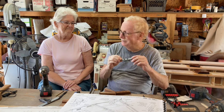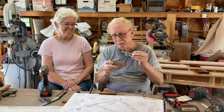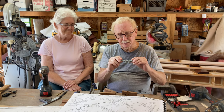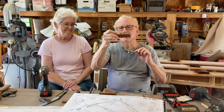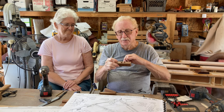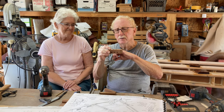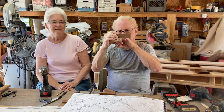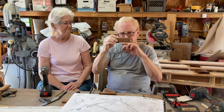It's held in place by a knot through this little hole, so that's a very important hole. It's a fairly simple project — really simple actually. We drilled five holes in each little block. The two up here on top will be where we drive the screws into the hull to hold the cleat on. The center one is the little hole we'll use to tie the lashing line through and tie a knot in it.